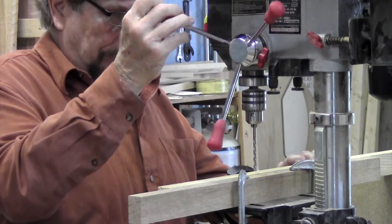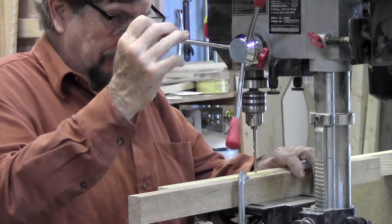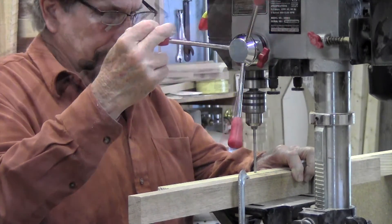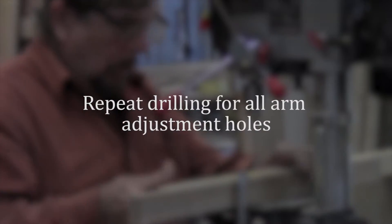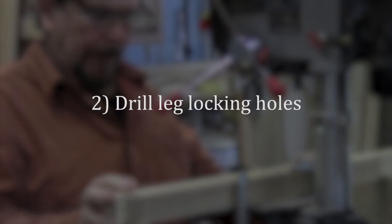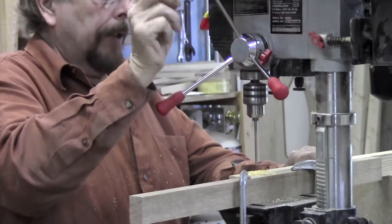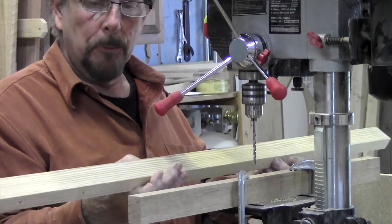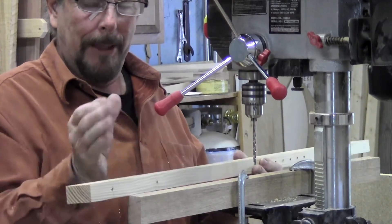Now we're going to drill the holes we just marked — these represent all the places we attach the crutch and our adjustment holes. We get it lined up at the drill press, pilot that little hole to make sure we're right in the middle, then turn on the power. Hole number one. Turning around, we've got the two bottom holes that are going to lock the leg piece in place — you want to be particularly accurate with these because they've got to go through the leg piece and all want to line up perfectly. Now all the holes are drilled through and we're ready to move on to the ripping stage, where we're going to rip this board down the middle to make the two separate bow pieces.